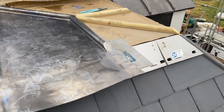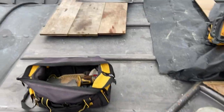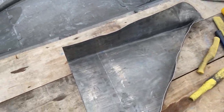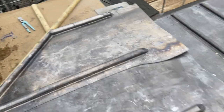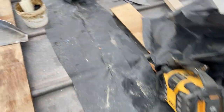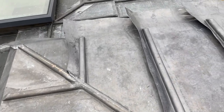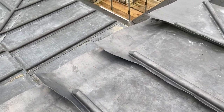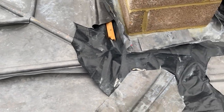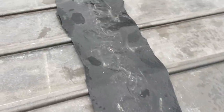I've just got the last bay going on on this side which I've just knocked up now. I'm going to get all this front edge down, trim up these splash laps, and get that side completely finished off. Then I'll come over to this side, dress these splash laps back down - I just had to lift them up to put a bit more oil underneath - and get all that front down. Splash laps trimmed up and get the front turned into the Nicholason vent. That just leaves a couple of bays around each chimney stack, but what I'll probably do next is concentrate on these hips and ridgeline.